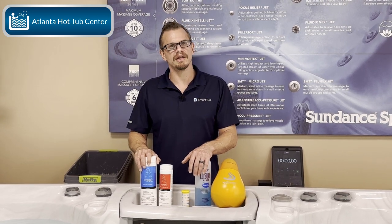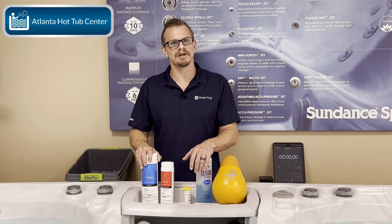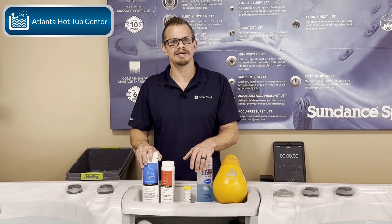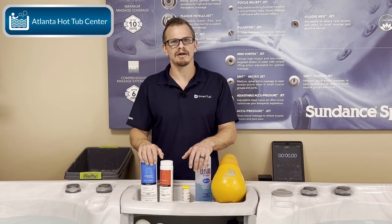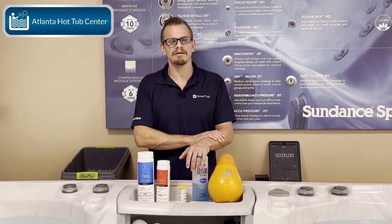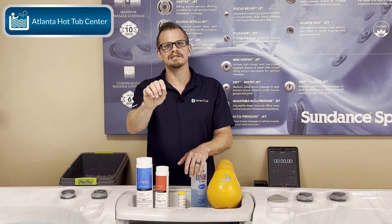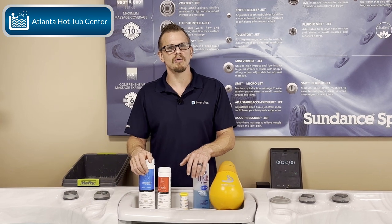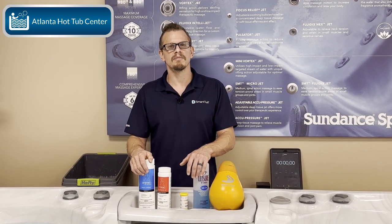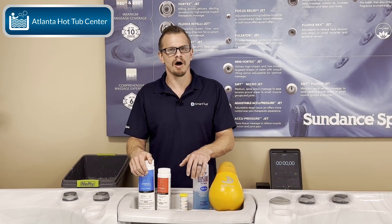Remember, when chlorine is in the water, it is inactive. It becomes active when it comes in contact with bacteria. When you enter the hot tub, you're bringing in bacteria. There's bacteria on our skin, right? So we bring that into the hot tub, the chlorine becomes active, it invades and destroys the bacteria, and you're left with something called chloramines, okay? Chloramines is the waste from chlorine, and it can cause a lot of problems in water chemistry.